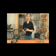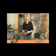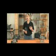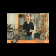The unit, of course, has variable speed, and it also has a tachometer style constant electronic system, which is a step above and beyond what we've had in previous routers, and of course it includes soft start to avoid the large startup torque when the unit is first turned on.